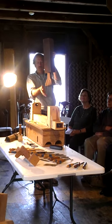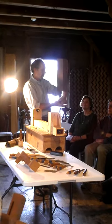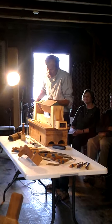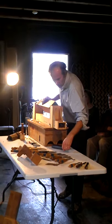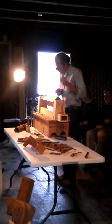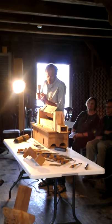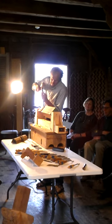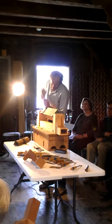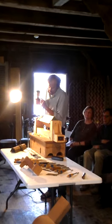The front claw is the guidepost — that one's just dead straight. The side ones come down and they'll hook back a little bit. The back one is also dead straight, perpendicular to the floor. So just by these first few cuts I've located these elements in space so I can do further details on them. Once I've roughed them out, I'll take a gouge that I've ground specifically for this, come up from the floor right in the corner, and round this right over. It will go all the way up to the ankle, where the claw blends in.